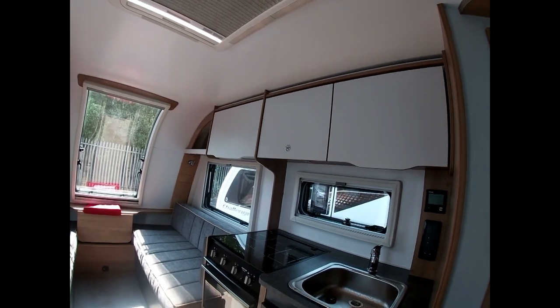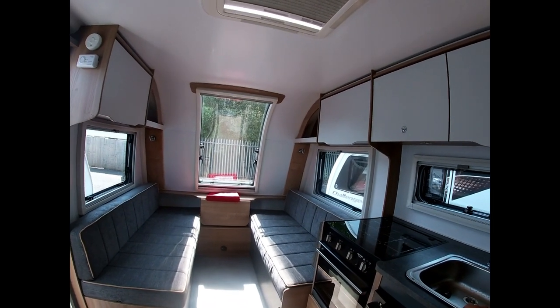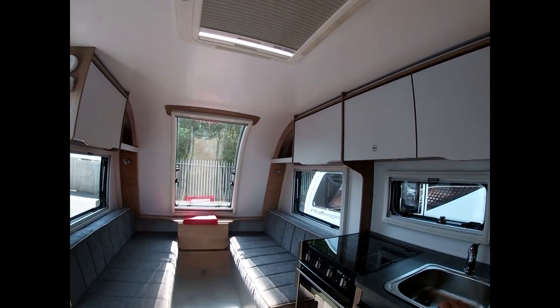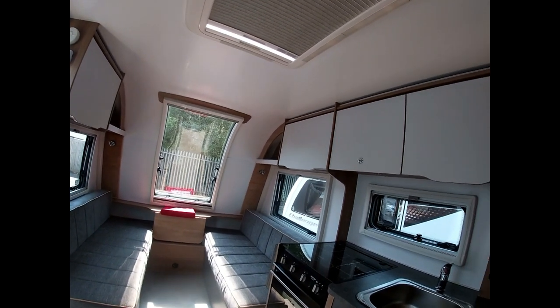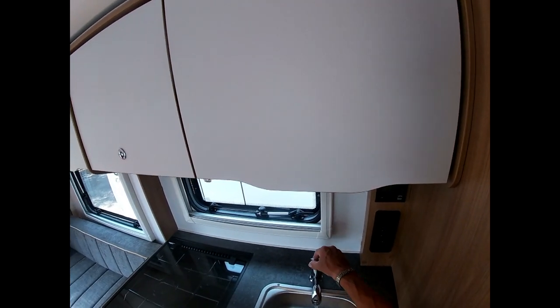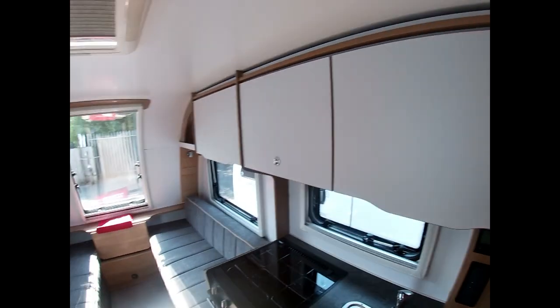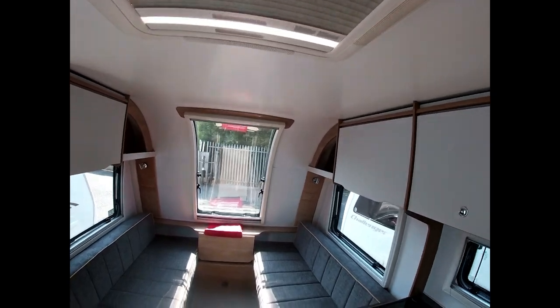So when we come to use it next season, if we don't do the following procedure, we do have the risk of those pipes being split and you having problems. So what do we need to do? Well, we need to go around and we need to open every tap in the mid position, halfway between hot and cold. Okay. One, two and three. We'll do the other two in a minute,